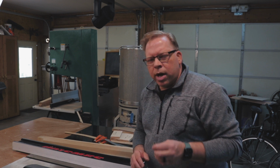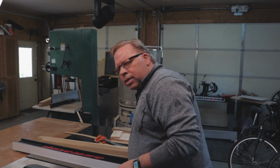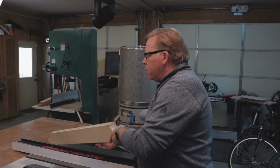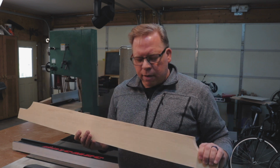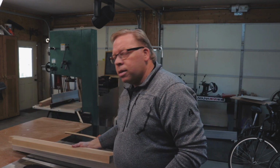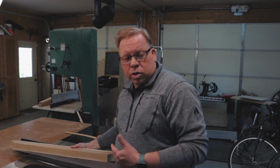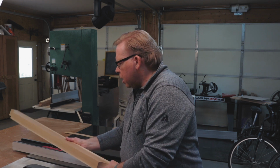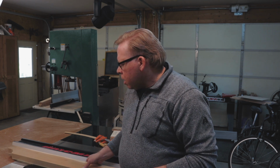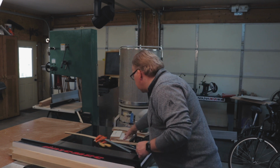The tip and trick is applying the same principle to a table saw. So the same principle applies. You take a piece of wood, something like this. I've got a fairly substantial one that I clamp to my table saw, to this fence on the table saw, and then I position that so that it rides just over the top of the blade. That becomes the bearing, and then I can cut pieces.